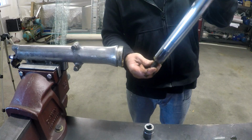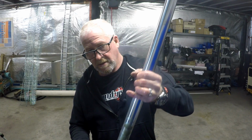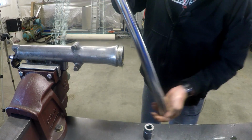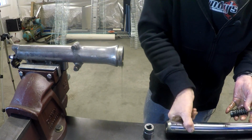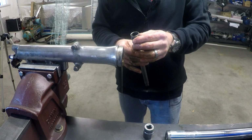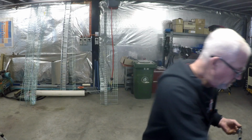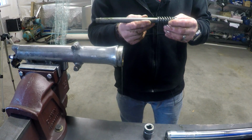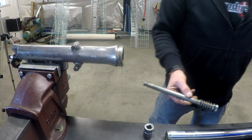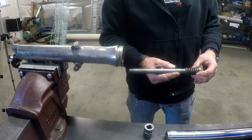So this is your dampener that you can hear there. That will come out the bottom like so. And there's our stanchion tube. Now these have a double hex in them that allows you to put something down through the bottom to hold that when you go to screw that guy back in again at the bottom. So, very similar to the XS1100s. There's a dampener piston and spring at the bottom and a compression spring at the top, and there's supposed to be oil in there.